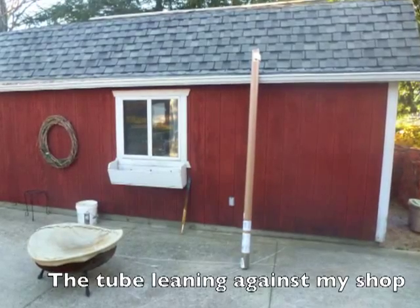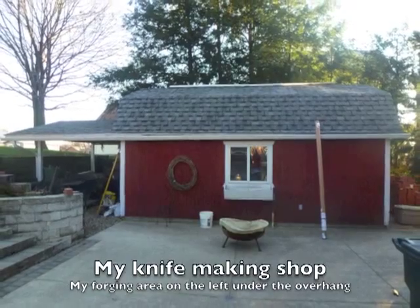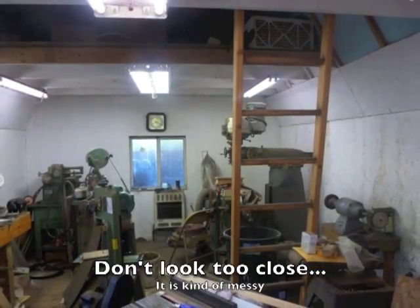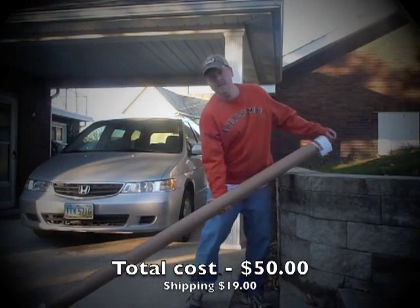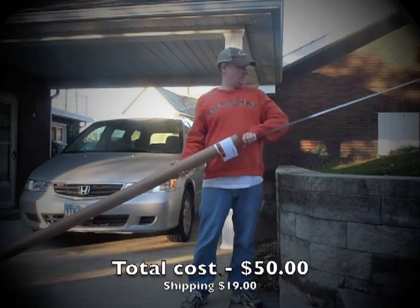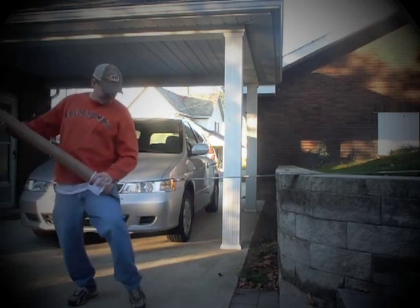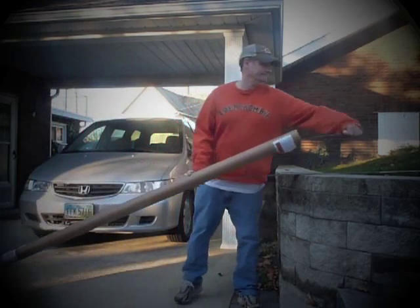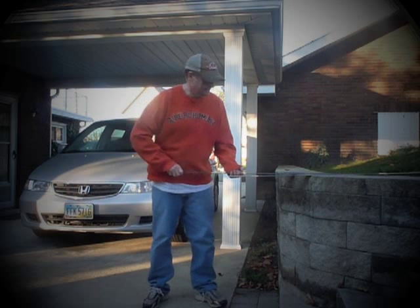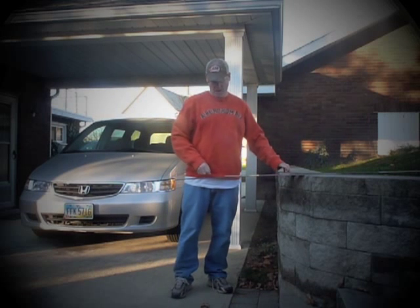Hope you enjoy this and it helps you in thinking about making knives, or at least gives you a source for buying steel that's cheaper and in bulk. So this is how the steel is shipped — in a heavy cardboard tube from Admiral Steel with a metal end cap screwed in. Because it's so soft, you have to be a little careful; it can bend under its own weight and lose its straightness. It's very clean, straight, and flat, with no decarb. It's inexpensive, and if you're interested in making a sword, this is where you'd get long pieces to cut and grind.